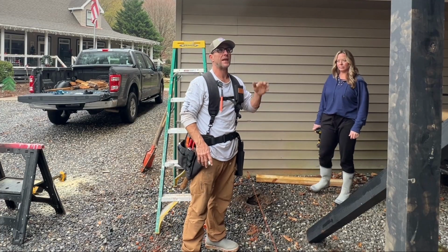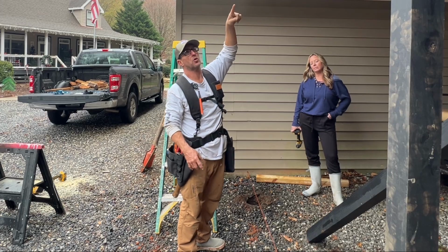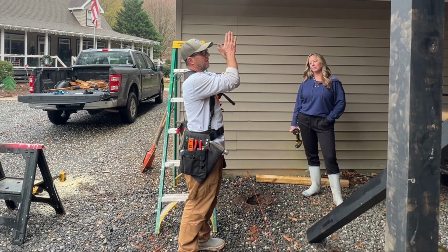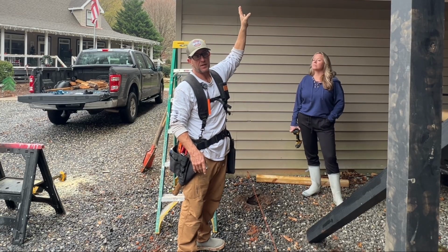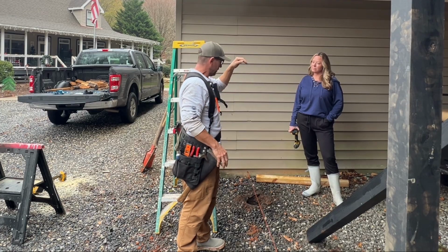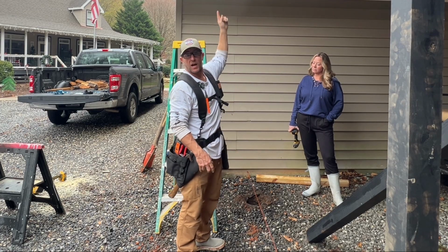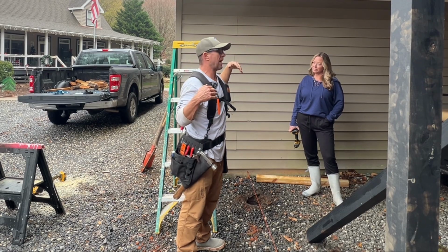All right, I got my angle cut. I got my post cut. What I did is I took a tape and I pulled 8'3" from the outside of that one over, and I leveled up a line as best I can to get an idea of where it's going to go up at the top. Because remember, I want an 8-foot opening clear. So I need to put the post in there, hold my thing to the mark, pick it up, and screw it all at the same time. I mean, I'm kind of Superman, but it ain't going to happen.